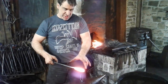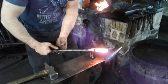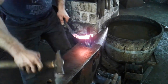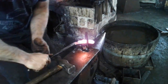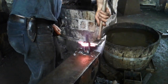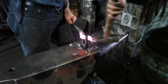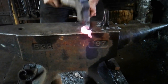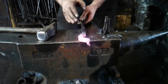Now I'm going to curve this one around to get the shape ready for these two pieces to come together. Once again using the bending forks — I'll bend it back a little bit, then out, put a bend on there, then flip it around in the forks and bring it back. Now I'm going to sharpen up the bend for the V-bit there, coming in with the cross-peen to do that, and ending up with this shape with the jaws more or less in line with the reins.